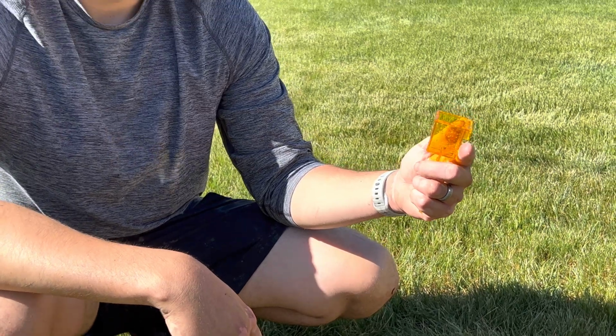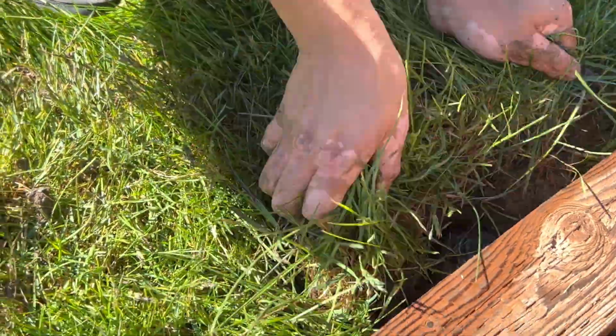After testing, we found out we're only putting an eighth of an inch down, running both zones. It looks like we will have to fix some sprinklers and also replace some that are too big. So overall, wrapping it up at Alex's house, we put a couple of cups out here and tested it. The cup test is going to show us what his lawn needs in his dry spots, because it tells us how long we have to run to get 1 inch of water.